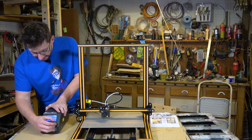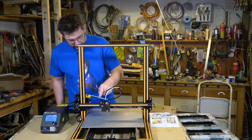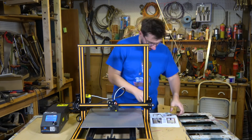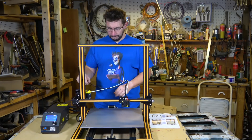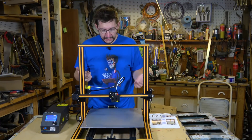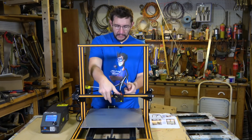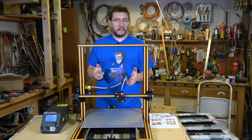Let's move the z-axis up. It looks like there's some hot glue in the track and that's resting over the belt. Let's see if we're even — good enough for now. Now let's tighten up the eccentrics on this. Let's move z up a little bit more so I can reach it. That was easy. I moved the eccentric — it was in the position furthest away from the extrusion. I moved it so now it's as close as it can be, and we've got easy movement and it doesn't shimmy.